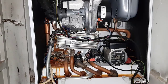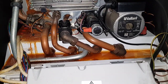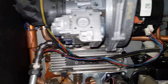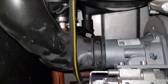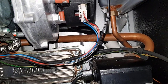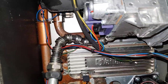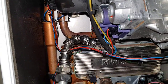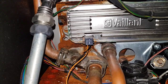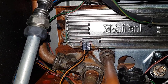I'm just going to give you a bit of history of what's happened in this boiler. So it's been leaking — you can see there. Where it's been leaking from was the condense pipe, which comes off the bottom of the sump here and goes along to the trap there. That had a hole in it and basically it's just all disintegrated. The condense was going straight down onto the plate heat exchanger, and it also went onto this sensor here, which is connected to the plate heat exchanger.